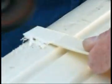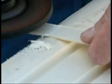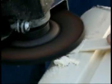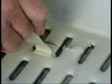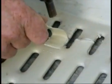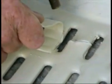We have found that for first-time users, it is difficult to use the full thickness filler strips for welding. To ease this process, the filler strips can be made thinner by grinding them down to a 1 mm thickness before being used in the welding process. Both techniques can be used on the inside of the bin, but it is recommended that only the welding rods are used on the inside, since this leaves a smoother finish.